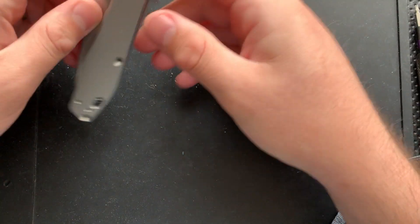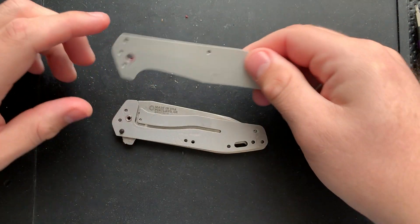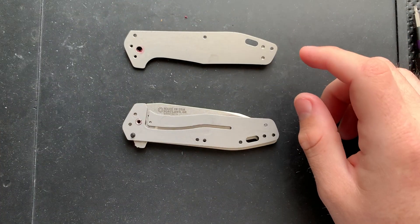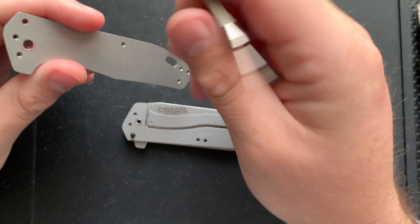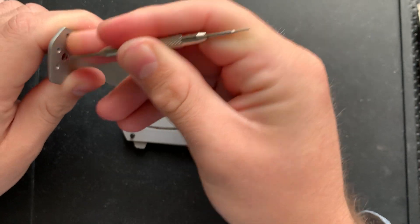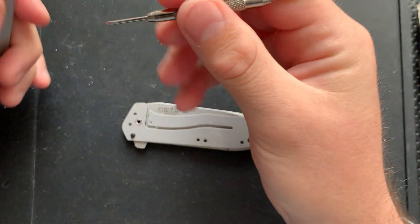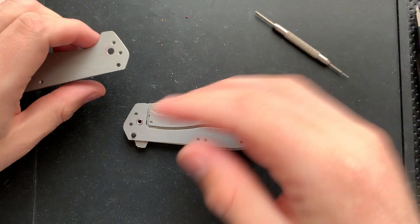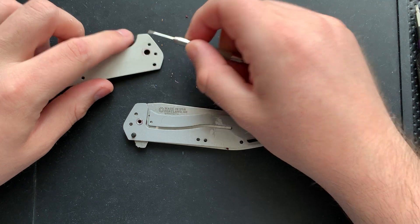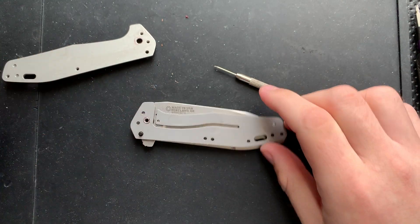Let's go ahead and take this guy the rest of the way apart. Very curious about the inside of this. The red devil is freaking everywhere in this. By the red devil, I mean red threadlocker — permanent threadlock — never something I generally recommend, always something I never recommend. Just because it tends to make disassembly and maintenance a little trickier. Although in this case, it looks like it was applied sort of in the general direction of the pivot rather than to the pivot directly. I'm wondering whether we're going to be able to improve things a little bit in here. Very often that can be the case, but it's not universal.